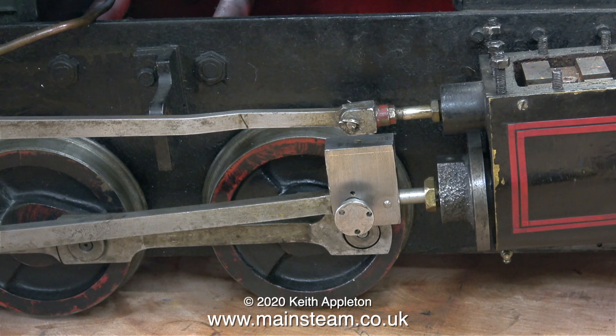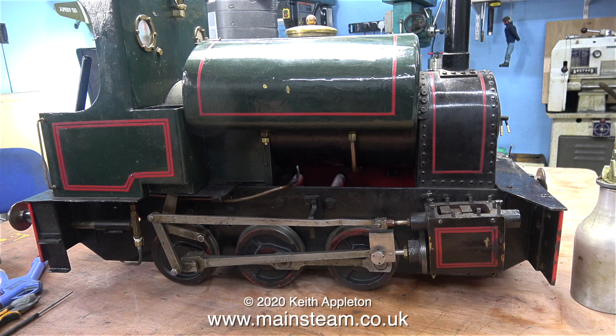I refitted the piston without the rings — this is a general arrangement, the slide bar is not fixed yet. The piston fits in the cylinder fine without the rings, but not when it has them on, because the rings are exactly one and a half inches in diameter. Should I hone out the cylinder to a larger diameter? That would take quite a while. Or should I machine the piston and fit soft packings or silicone piston rings? I will think on this further, but that's it for now.